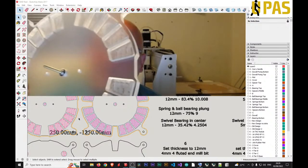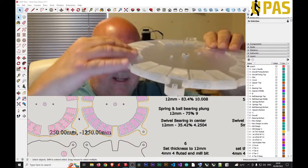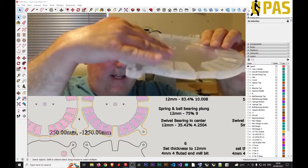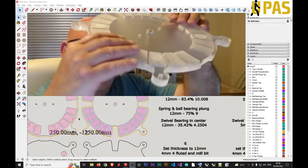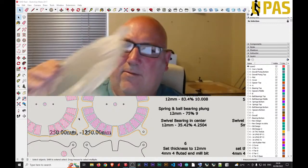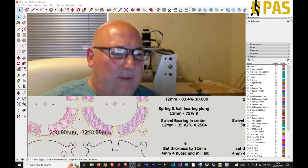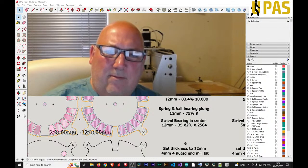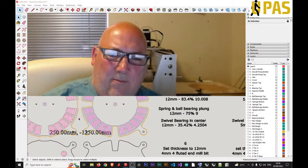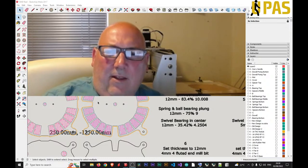It's okay but not ideal. It's so thin you can feel the blistering — it's smooth and flat here but blistering a bit over there. It doesn't matter on this base piece because the blistering is on the bottom where the feet are. But what matters is the tiers in between — they've got to be flush. So I'm going to reduce the 10mm pocket to 9mm. That way if it does go a bit deep, there's still at least 1.8mm left.